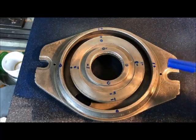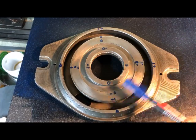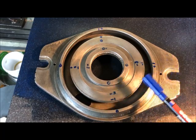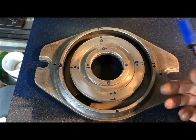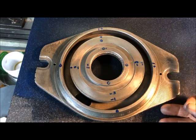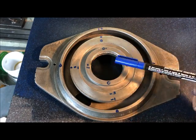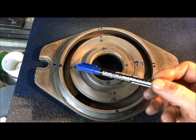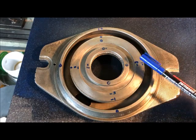These are the numbers I get — the most deviation is here, minus two and three respectively, and one one. But I have plus on the other side and zero there, so I don't think the surfaces underneath here are out of plane — I think it's wear. It seems to be plus one, zero, one — so it's more or less within one hundredth, with two exceptions.